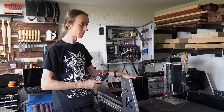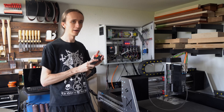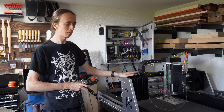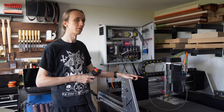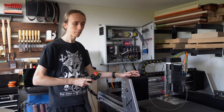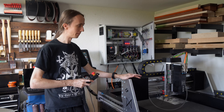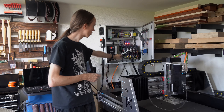As you can see it moves around. I was confused about why the X-axis wasn't moving with the jog pendant, but that's because I've just gotten started with the tuning of these servo motors. While they move around fine and it already works pretty well - I could use the CNC like this - I know that by tuning the servos I can get much better performance: positional accuracy will be better and maybe I can get higher accelerations.